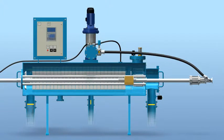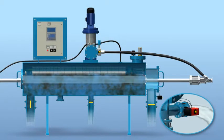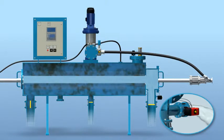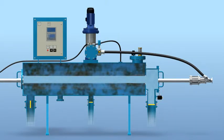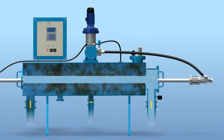Once the spray cleaning of all cassettes is completed, the flushing and drain control valves are closed, and the inlet and filter-to-waste control valves are opened. Raw liquid enters the filter and fills it up. Air is displaced via the air release valve, and initial filtrate is passed through the filter-to-waste control valve. The filter-to-waste control valve then closes, followed by the outlet control valve opening. The control unit turns off the flushing pump. The cleaning cycle takes up to 10 minutes. The filter is now back on line.